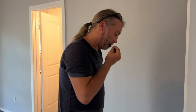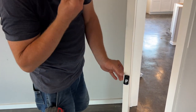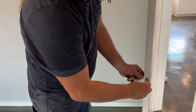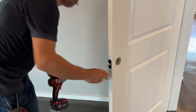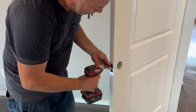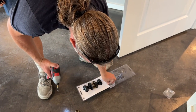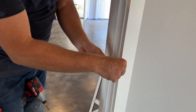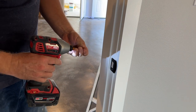So we've got the door latch cut. You want to put it in there so that it catches on the door. This has got some packaging around it - we'll get that out. Now you take two of your small screws and put them in there - you're a third of the way done. This is called a strike plate - that's what the latch catches on to. This goes in here like this, and you take the other two small screws. Hopefully you have a drill.